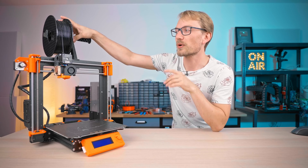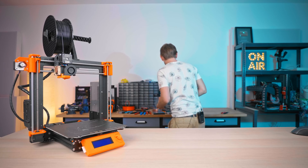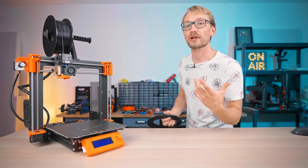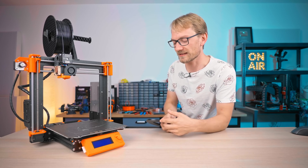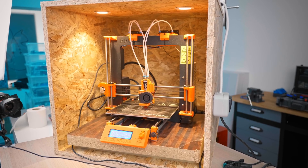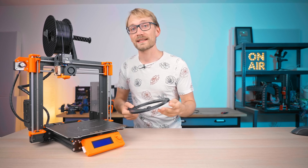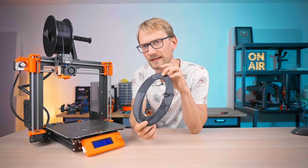This is the Prusament Polycarbonate Blend. Polycarbonate is basically the most temperature-resistant filament you can print on normal printers, short of PI or PEK or things like that. As such, I always recommend printing in a fully enclosed space with raised ambient temperatures — and this wasn't that. Honestly, I'm surprised it went as well as it did, but you can see up here it started kind of curling.